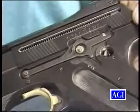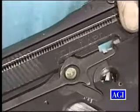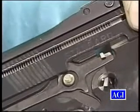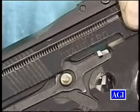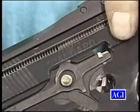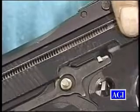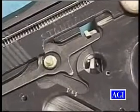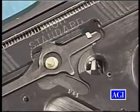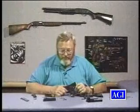So when the gun is closed, ready to fire, the trigger bar rises up and engages the sear. But when it's not closed, see, we don't have that engagement, do we? We've lost it. When it goes closed, it does engage. See it rise up? If it shouldn't close, it doesn't fire. You see that? Very, very simple, very, very basic, and used on an awful lot of semi-automatic pistols in the world today.